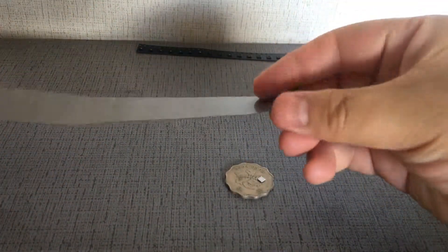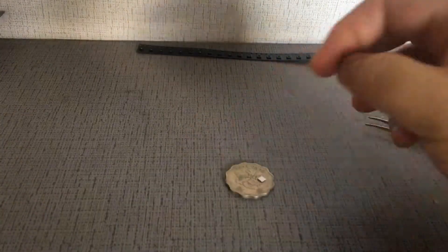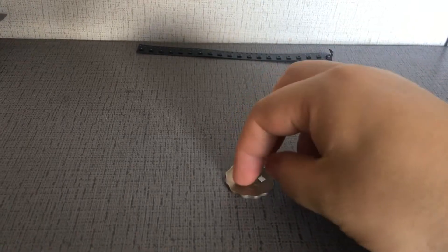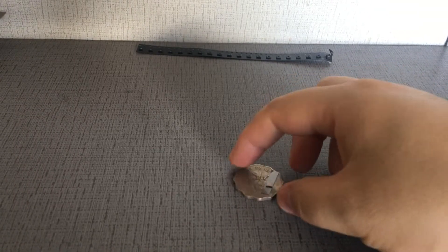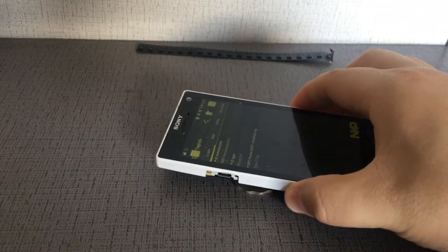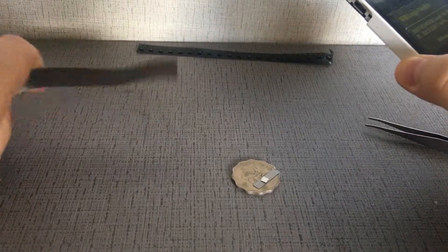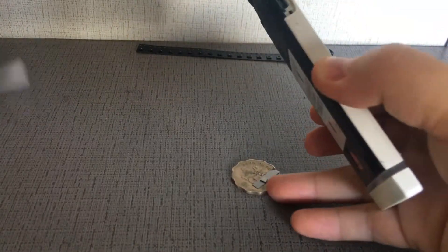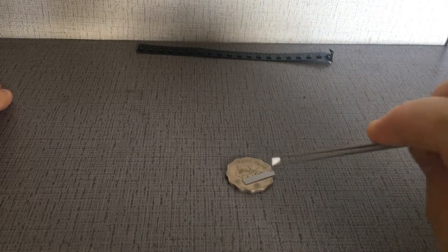In this scenario, you need to add a ferrite layer. This one is 0.1 millimeters in thickness — I just cut a small piece. You put the ferrite layer at the back and the chip on top of it. You can check the performance on metal — it's readable. After adding the ferrite layer on the bottom of the tag, it works.